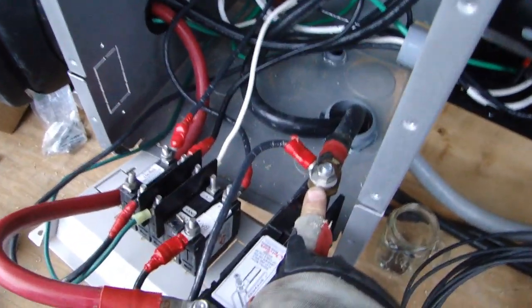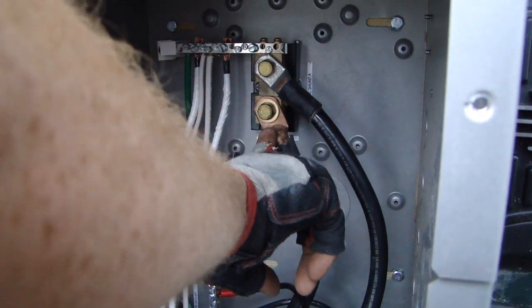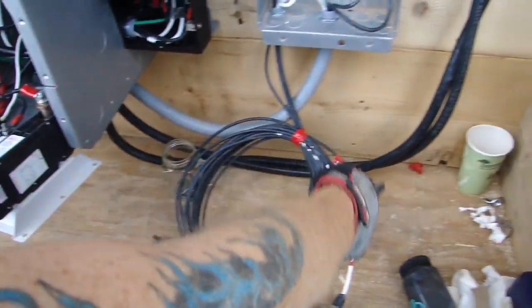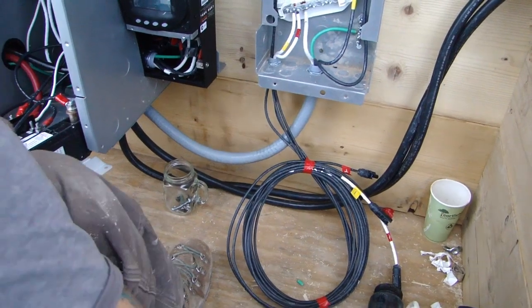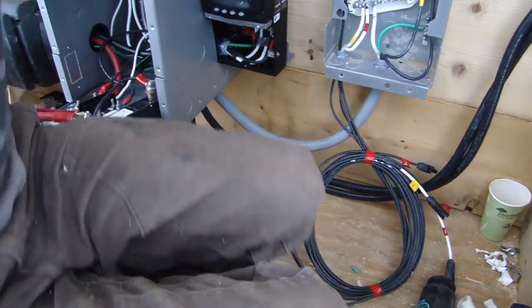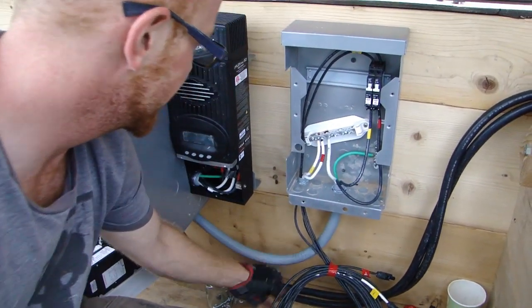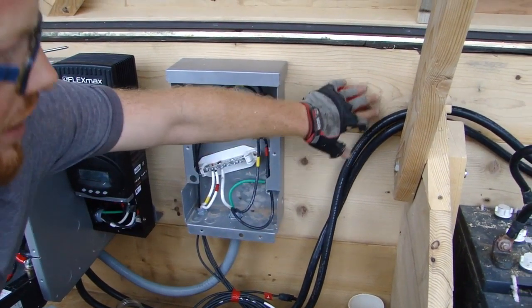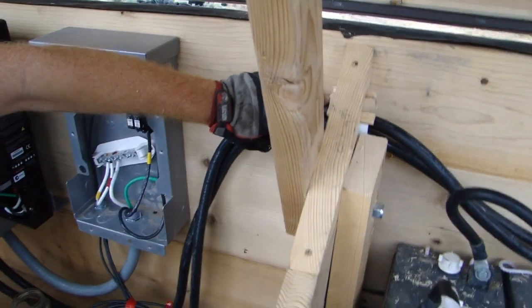This battery cable and this negative battery cable that goes into the shunt both come into the negative battery cable here, positive battery cable here. These go through the bottom and will go over here. You want to secure these to the wall with flex clamps you screw on — put one about here and a couple on these to keep them tidy against the wall. Put one on either side to take stress off the cables.